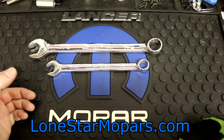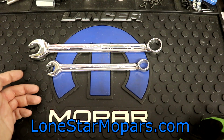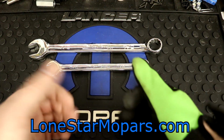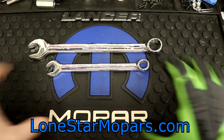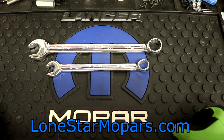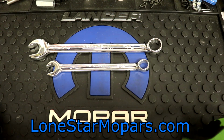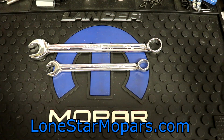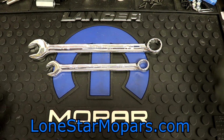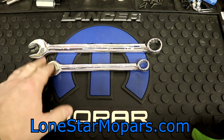So coming in, I primarily run Milton fittings, and for whatever reason, I didn't think of this, because I do it all the time, but typically on your airline, you're going to have 9/16 on your crimped fitting. What do you need to spin on your quick coupler? Well, in the case of everything I use, it's 5/8, and I screwed the pooch and didn't buy one. Here it is. The good news is I ordered this and it shipped, because 5/8 just isn't as common or in demand, I suppose. So this should take care of me.